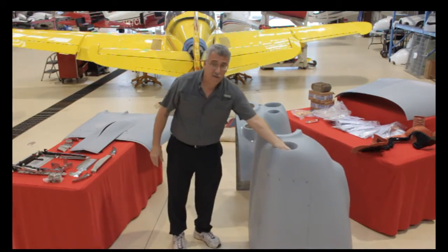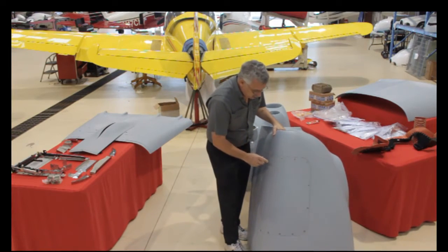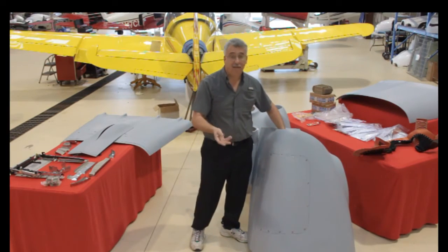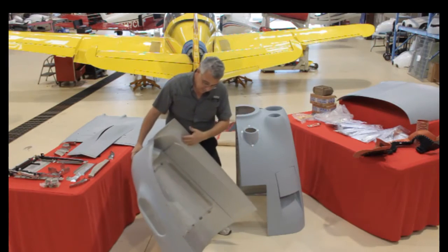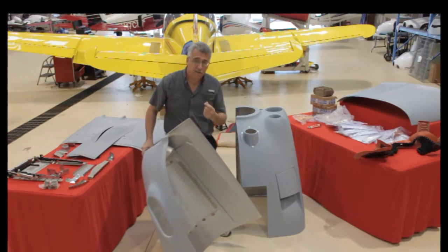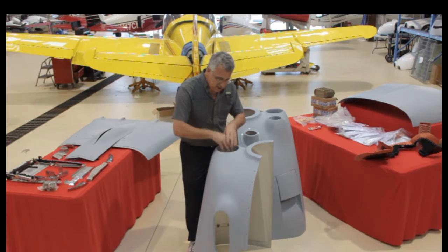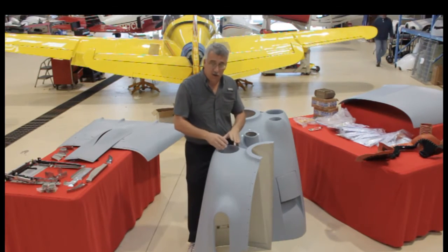Split left and right, you'll be able to take off the left side of the cowling pretty easily and work on your airplane. During preflight, we install two doors with quarter-turn fasteners and a hinge, one on each side. It makes it much easier to do a good preflight because you can actually see what's going on in that engine without having to pull the whole top of the cowling off. The cowling itself is a carbon fiber fiberglass laminate. We put a heat reflective material on the inside that keeps that waffly looking pattern from developing in the composites. We have a nice duct going back for the cooling air inlet — as it goes aft, this duct expands so the air can slow down, expand, and pressurize the top of the plenum. It's a very efficient inlet.